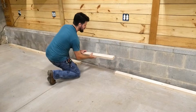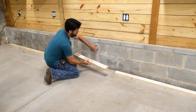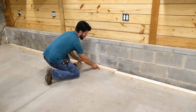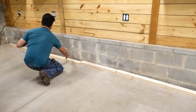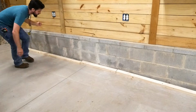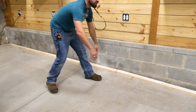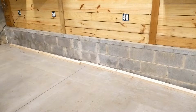So this 30-inch piece is going to be the center where the miter saw is actually installed. I have a line I drew on this wall that is centered between this opening. And that board's going to go right there. We have a 5-foot section that's going to be going off to the right, and then a large 8-foot section that's going off to the left. The 8-foot section is going to have legs on both ends and in the middle, and the 5-foot section is going to have a leg on each end. So I need to figure out what the length of all these legs need to be.